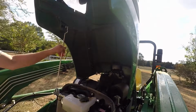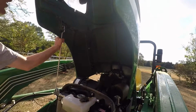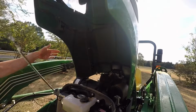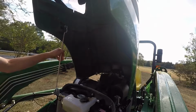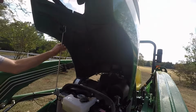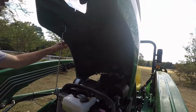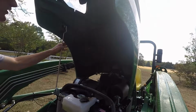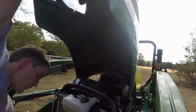When you go to take it down, you'll see this rod is under tension. See, it's all the way out here. That's where the rod stops naturally. You have to either bend the rod to put it in there, or bend the hood over to put it in. Really poor design if you ask me. You've got to manhandle it into that hole and shove it like that to get it in. And watch, when I push it over, I'm not going to put any pressure on it. It pops out like that. It's under tension. Stops right there. That's kind of poor engineering if you ask me. It should either click in somewhere if you're going to have these linkages. Really, you should have gas struts, but I think they could have paid a little more attention and made it a little more consumer friendly, especially since you have to take the whole front guard off to get to it. So I think that's kind of a quality control issue, poor engineering on John Deere's part.